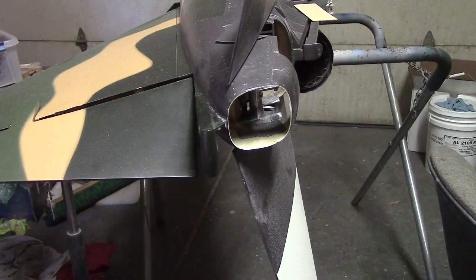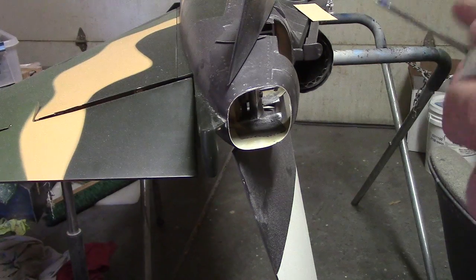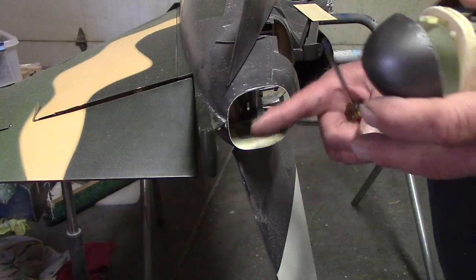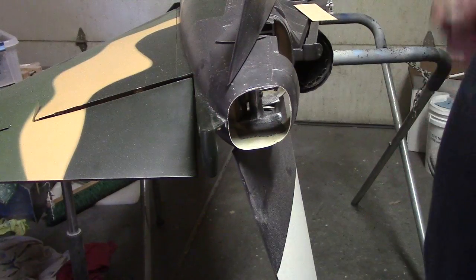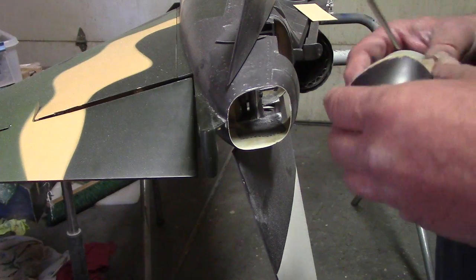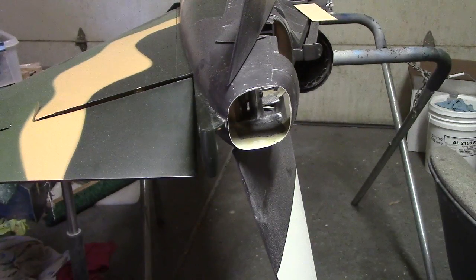Because of the angle, it won't go in from the back, so I used a nice heavy-duty brass hinge right there. It's going to stick out a little bit on the bottom, but it's worth it to have a good hinge that won't wobble and won't break. If this chute compartment comes out in flight, bad things can happen. Of course we've got it tied with a little fishing string and swivels up here so it's supposed to break off safely if it ever comes out — but we don't want that to happen.